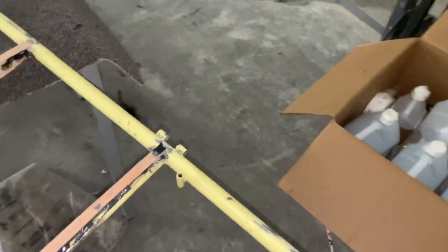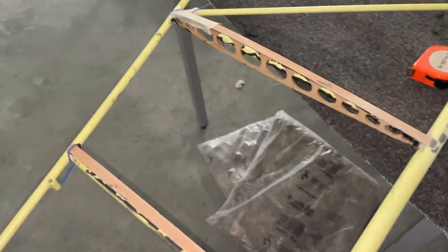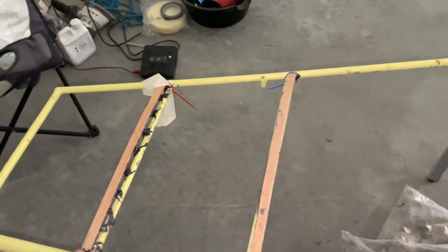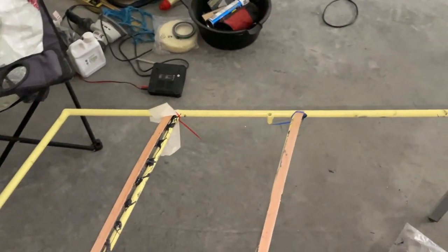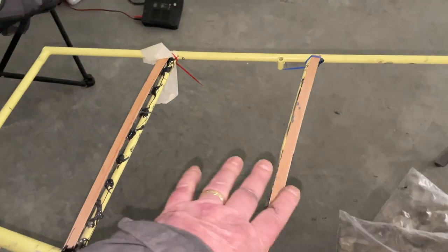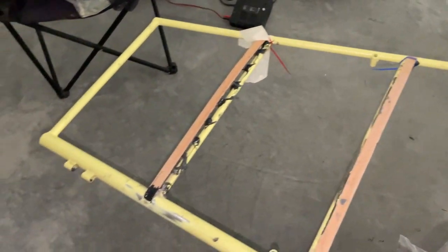That's that. This paintwork as well, and the cap strips, there's been a bit of sanding on them now. You remember that I applied a two-pack clear coat to these to seal them. Now, it needs to be two-pack. I think there's an issue with varnishes that are not two-pack, with them softening the glue. So it needs to be hardened varnish.